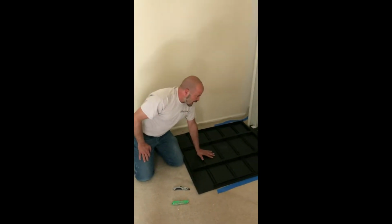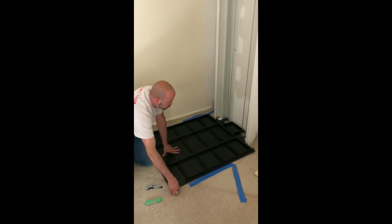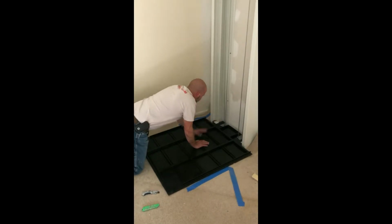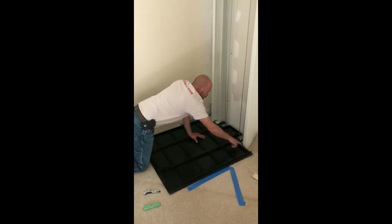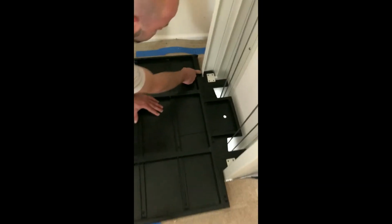All right, so now we're getting ready to cut the carpet. Now what I've done, I took in the hatch and I have laid it upside down to get as close as I can to the carpet. I stuck my guides in, and I positioned it the way I want it on the rail. So I got my 1/8 inch gap here, 1/8 inch gap here. I got it centered in between here. And so now I'm gonna take my razor knife and trace the hatch onto the carpet.